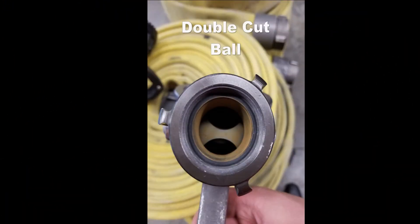This photo depicts a double cut ball in the closed position. The purpose of the cuts is to make the opening and closing action of the valve easier by capturing the water coming in under pressure and using it to help pop the valve open or closed. However, when fully open, this type of design creates void spaces in the waterway, creating turbulence which will affect the integrity of a solid stream.